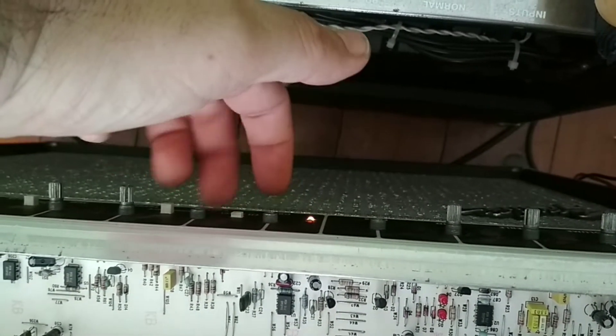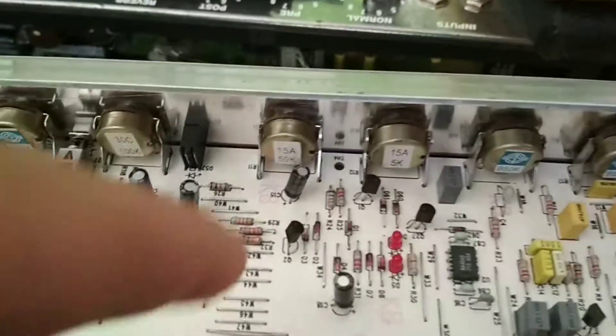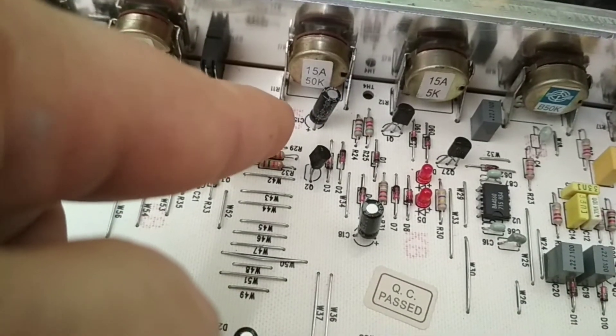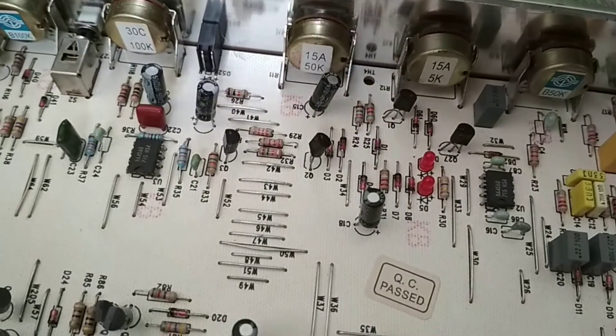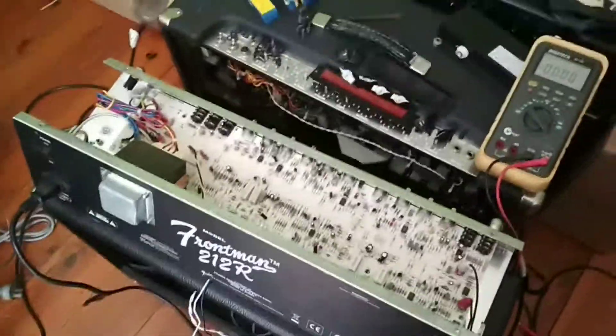These pots need to be replaced as well, because they were super glued in. When I pulled the knobs off, the pots came with them and broke. I won't bother videoing that - it's just a matter of unsoldering these pots that you can never buy in shops, because they have the grounding plate on either side. What I'm going to do is just put in regular pots and run a ground wire into each side, soldering the ground wire to the body of the pot and through the holes in the PCB. Anyway, thanks for watching, please subscribe. See you next time.